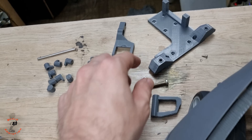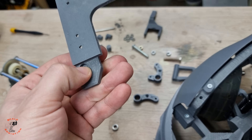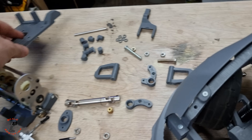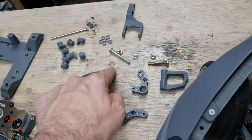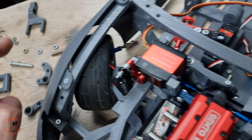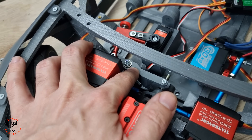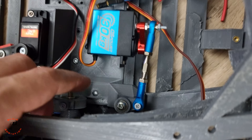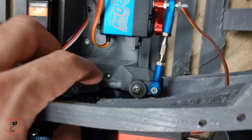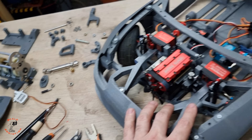For the steering I printed this part again — now the bolts will be underneath. One side of the bolt will be 3 centimeters and the other will be 4 centimeters, because on one side there's a clutch arm. So that side is 4cm and the other side is only 3cm since it's only holding the steering arm. We're going to assemble all that together.